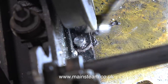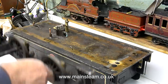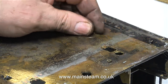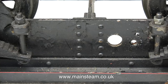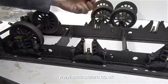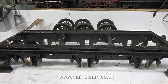The sad thing, of course, is there are quite a lot of these bolts. They're very nice bolts, but when I put it back together I'm going to use bolts that either have an Allen cap head or at least a slot. After quite a long time I finally managed to make it so I could lift the frame off the tank. And not all of them were bolts - this one is a stud and a nut, so I'm replacing the nut on the stud so it doesn't get damaged. The paintwork on the frames is considerably worse than the paintwork on the tender body. The next job is to remove the wheels and axle boxes, then I'll be able to thoroughly clean the paint off the wheels and axle boxes, not forgetting the frames as well. I may just take the frames to the steam workshop and use their shot blasting cabinet - it will save time. Not one of the best jobs on a miniature steam locomotive, but it has to be done.